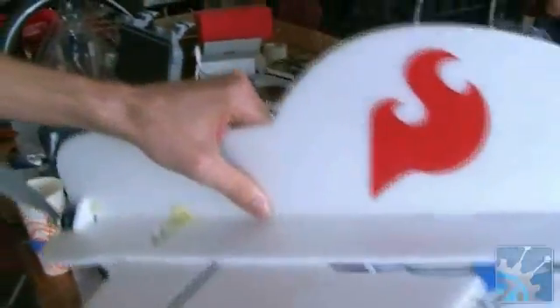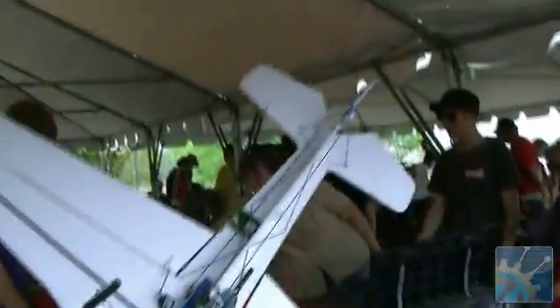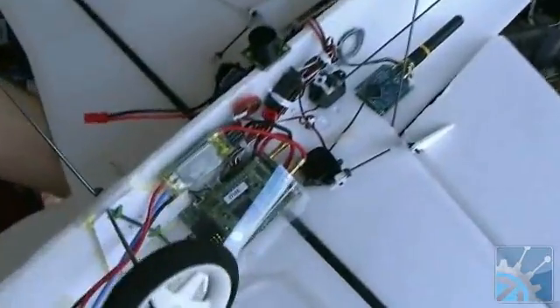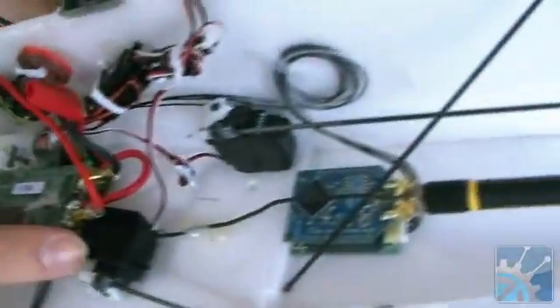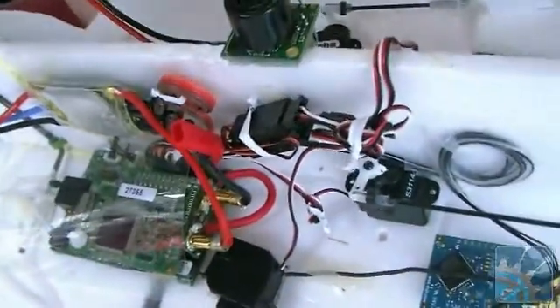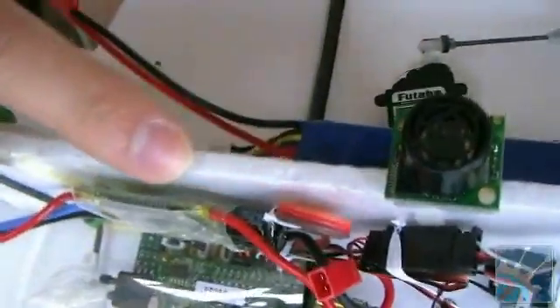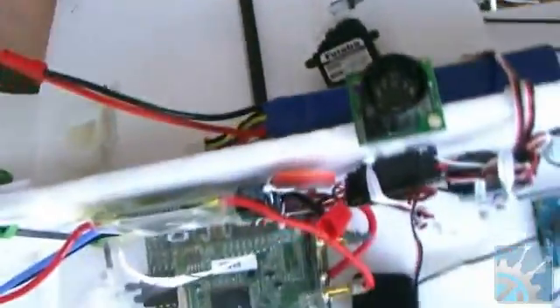My name is Antonio, and I brought the Roboto paper plane. It looks really basic — it's a two-dimensional airfoil. On the bottom we have all the gadgets: the autopilot, servo actuators, communication radios, and a sonar altimeter. This plane can fly two meters above the ground around the track, so it uses the sonar for altitude, and we have a GPS back here.